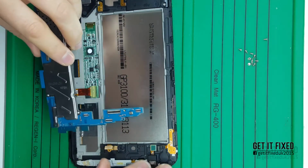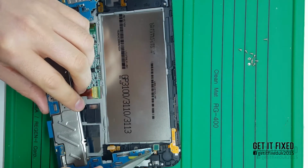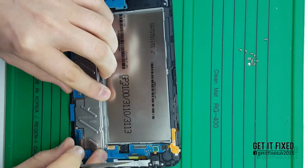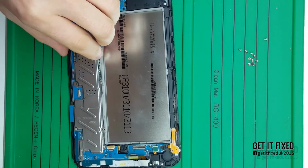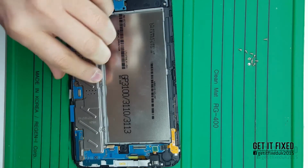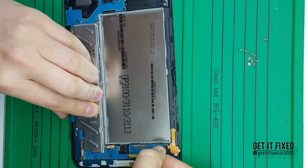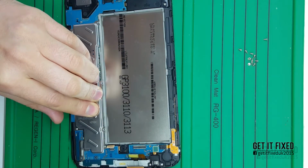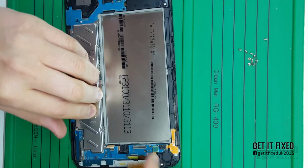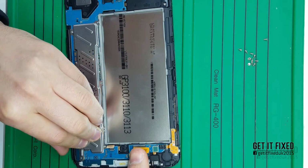After you do a charging port repair or charging work in any device, any phone, any tablet, if you change a chip or whatever, make sure it charges from 0 to 100. But if you can't wait that long because the customer is in a rush, make sure it charges for at least 10%, and record how long it took. For this tablet, I think it's 4 watts or something like that. I don't remember, I need to check.